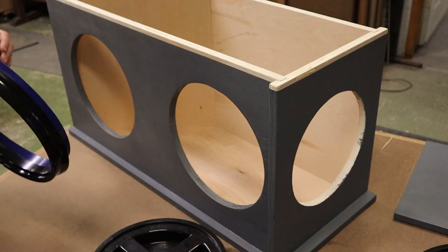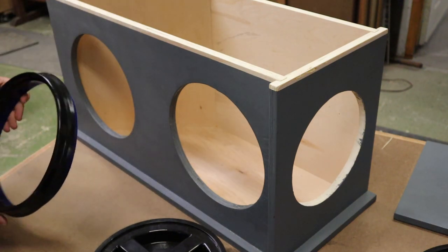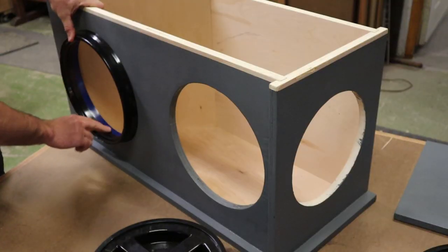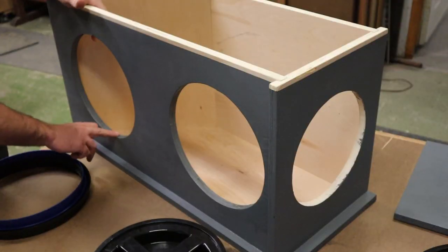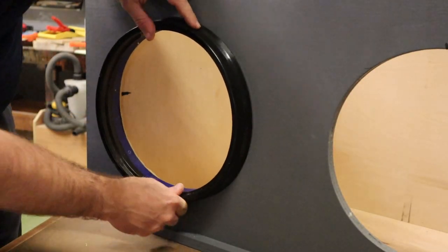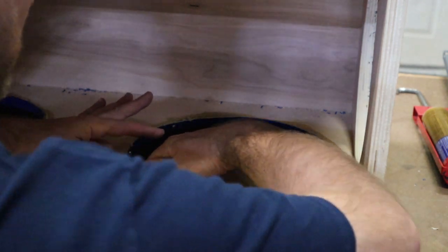Installing the Gamma Seal lid is really easy. Make sure your holes are cut just big enough for the bucket to fit — it's better to cut it just a little smaller and sneak up on it. Once it's in, make a reference line so you can put it back in the same spot, and pre-drill several holes around the edge. Then take the lid back out, put a nice bead of caulk — silicone, liquid nail, something like that — to seal it off. Reinstall the ring, line up your mark, and install your screws. If the bucket lid protrudes beyond the cabinet, go ahead and trim it flush with a knife.